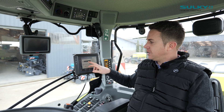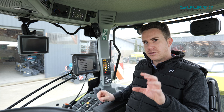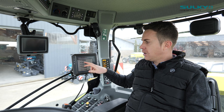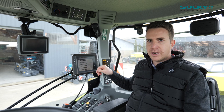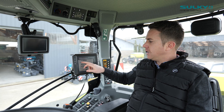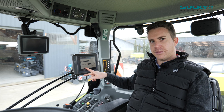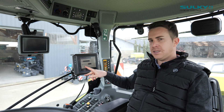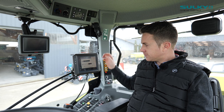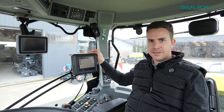The last option on the eDrive lets you choose whether you want to sow the full working width, or — very interesting for organic farmers — you can do one row on and two off. In that case you select it, and it will automatically open the rows to give you 30 centimeters row spacing, meaning you can do inter-row cultivation. So that's very easy. That was it for the Quartz Terminal — fantastic box.